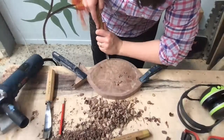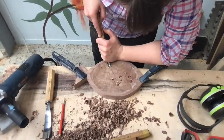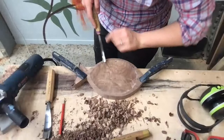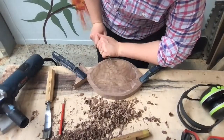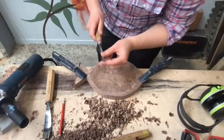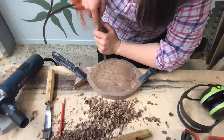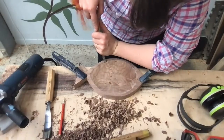Get a high point there, I didn't smooth out very well. You can see as it's working great down the hill. And then as I'm coming here, I'm pushing my back hand down too much. And because it's rounded, it's sort of just like skidding off on the back of the tool there. So I need to remind myself to hold it slightly more upright. Oh, how better did that work?